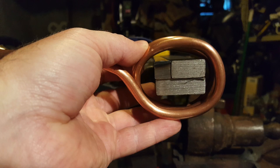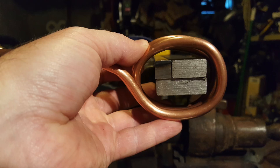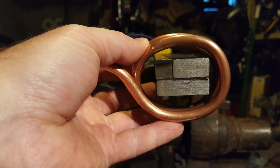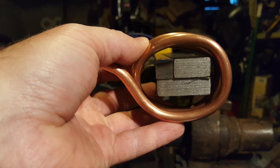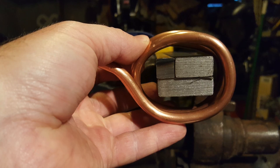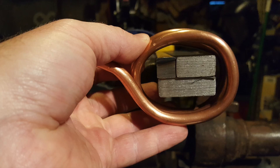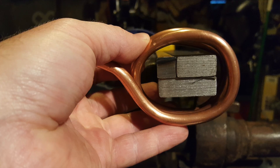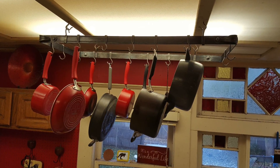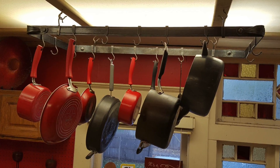The final dimensions look pretty good. Between 30 or more layers of that newsprint and the rebound of the copper itself, there's about the right amount of room to heat a folded piece of that 1.5 inch by 1 inch stock. But I should have reviewed Gerald's video first — he spreads the cheeks of the blade before welding in the bit. This will work for the first weld near the eye, but I'll need a wider coil for the rest. This coil has proven plenty useful making a pot rack for my wife's birthday, so I'll have to make another coil before I start the axe.